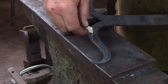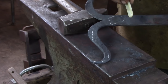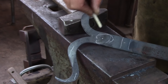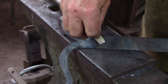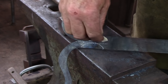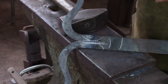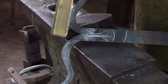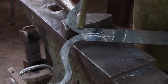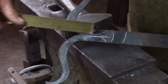I'm going to cut for my two horns a little later and also sweeten up that end, but I'll do that after I've made the face and rolled the eye of the hinge — I don't want to lose the horns in the fire while working on this. To pull the material out for the face I'm going to work from the back of the bar and use my rounding hammer to create two divots, trying to leave that spine as it's a structural component of the hinge. We're going to be putting screw holes in here, and the barrel needs something running through the middle to carry that weight. Depending on your forge, you may have to sever this from the bar so you can hold it with tongs — another reason why we didn't cut those horns yet, so you can get your tongs in there.